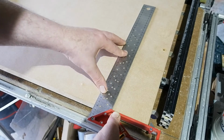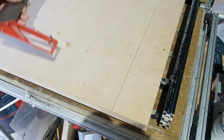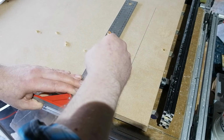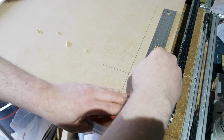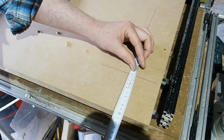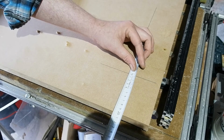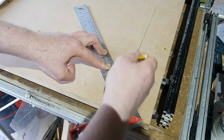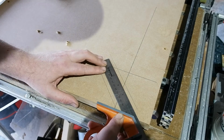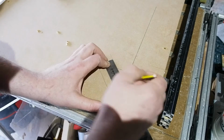No splaying of the lines at all with a flip and mark. So far so good. I quite like that the ruler is so wide on this. Helps it feel planted. I'm using the 10cm hole here with a standard but not sharp pencil. About half a mm out according to my tape, but I doubt that would be an issue with a 2mm pencil lead. Just my pencil being too small for the hole. A couple of lines using the 45 on the stock. Lines seem to match my combi, which I know is good, just fine.